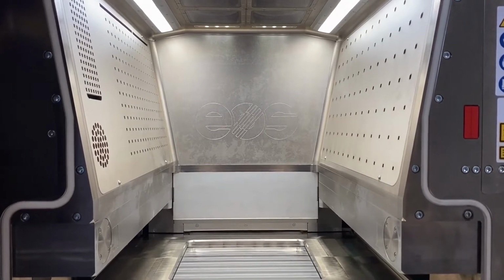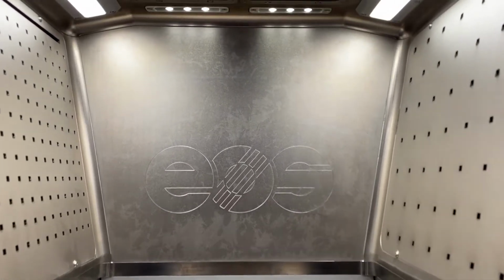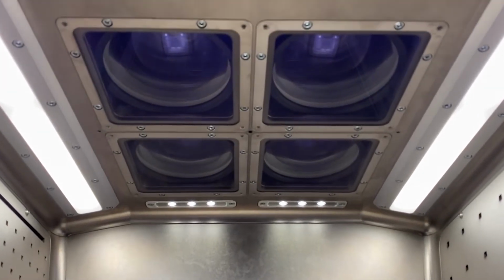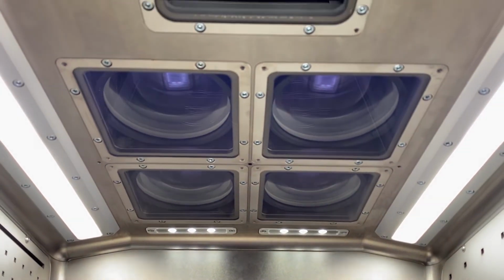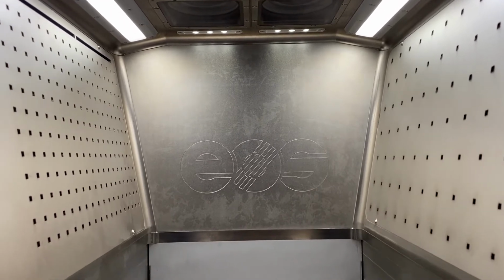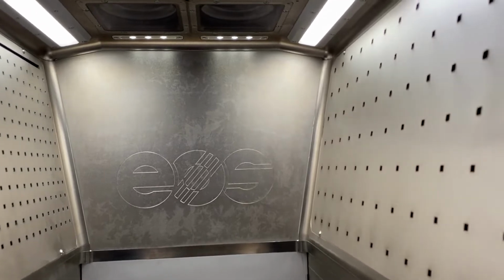The laser beams are guided and positioned by a new generation of digital scanners. The scanners are arranged in the top of the process chamber, close to each other, to form the basis for innovative scanning technologies. We designed the process chamber completely new from scratch, for a laminar gas flow coming from left to right for a really smooth process behavior.